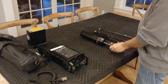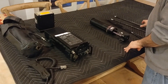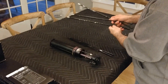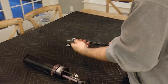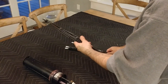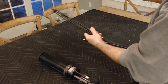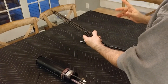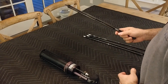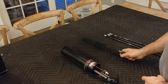What we're going to do here is show you how to assemble one of these TRIVEC Avant satellite antennas. We have three stands and a set of director elements. Often there are two sets of director elements, but we only have one set here. For receive-only applications, one set is actually better because it has a wider view of the sky, making it easier to locate the satellite. With two director elements, you get more forward power but it's more pinpointed, so it's harder to find the satellite.